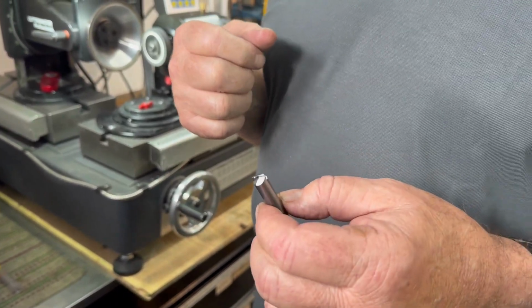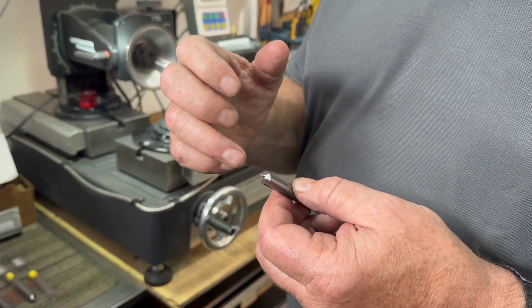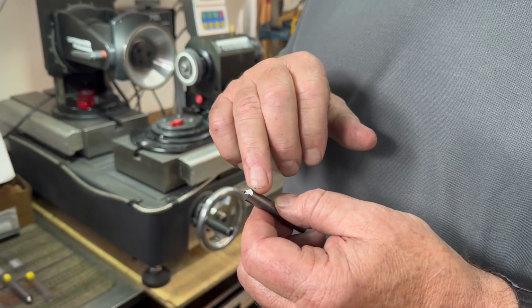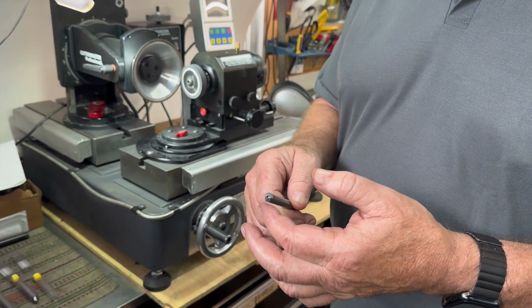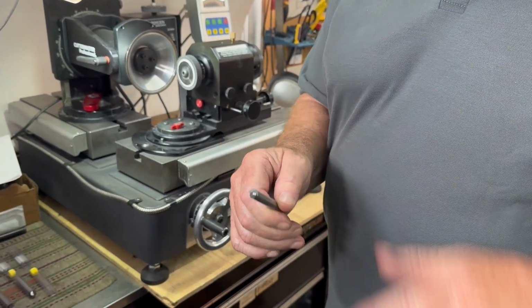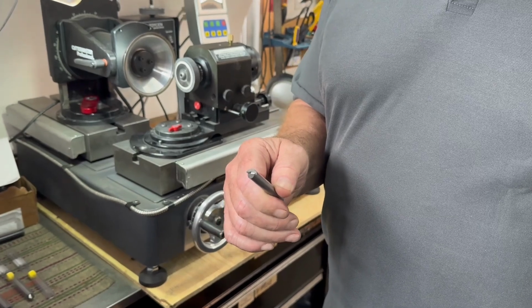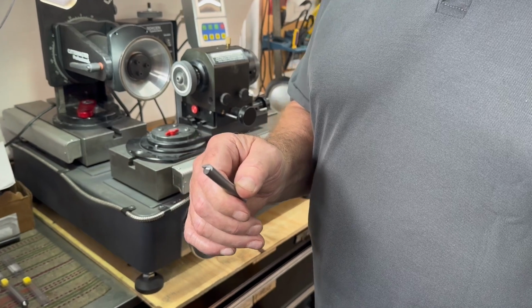To make this tool work well, the only thing you really need to do is have a good primary grind and enough clearance. So as long as you get the basics right, you get the primary and maybe the secondary, and you have a reasonable center, the grind profile doesn't actually matter. Secondary angles are just clearance angles. Primaries do the cutting.